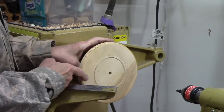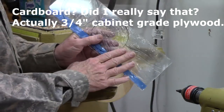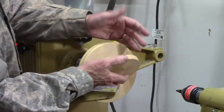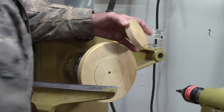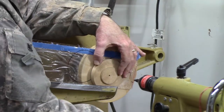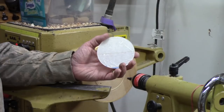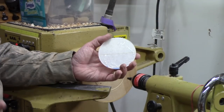I mounted a scrap of cardboard on one of my new faceplate rings, mounted it on my chuck. Then I cut out a square of this acrylic and mounted it with some double-stick tape. Then I used a template — I took a scrap of Bradford Pear spindle scrap that I had, turned it round to the exact dimension while it was still on the lathe and running true. I drilled a hole through it, so when I put the square on here, I could bring up the tailstock support and give it support. Then I just used a thin parting tool and off it went. Here's the piece of acrylic — still got double-stick tape on it and the protective covering on the other side. It just goes to show there are things you can do on the lathe to problem-solve. There might be better ways, but if you're a woodturner, this is a way you can do it.